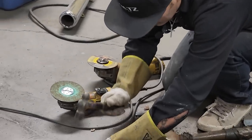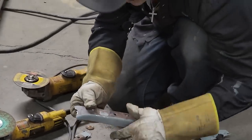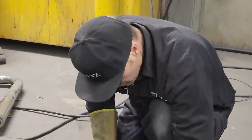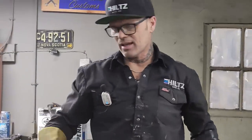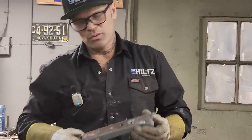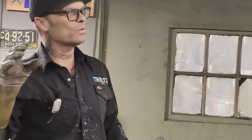I'm kind of repairing this to look after it. And anytime anybody's repairing something to look after, I dare say that they don't even want it in the rain most times. So if you can get a bit over the top on this stuff, think I gotta have primer in between this, I gotta put weld through primer, I gotta wash it all down with this special stuff before I put any body filler on, you really are taking it to another level,